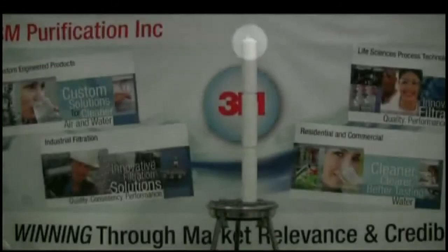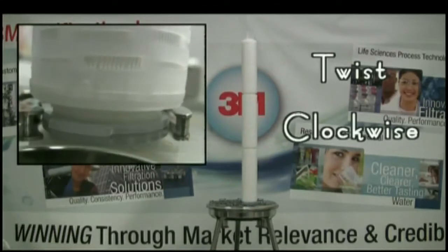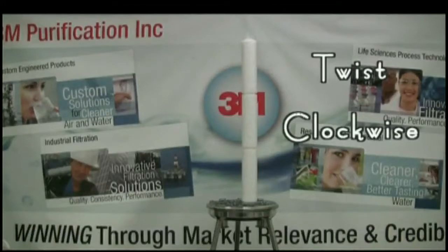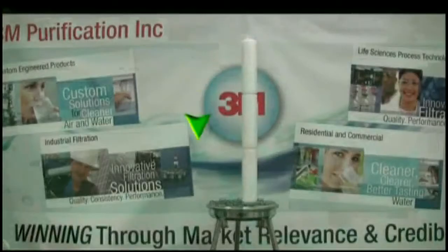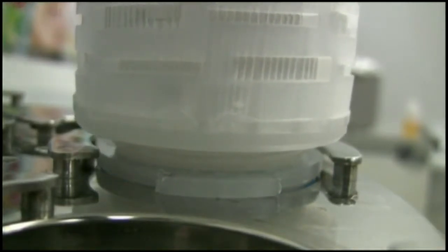When it appears the O-rings are not visible and the filter is fully lowered into the receptor, place both hands atop the closed end of the filter and rotate in the clockwise direction, making sure to keep the filter in the perpendicular position. This will position the tabs beneath the housing brackets, locking the filter into place. Conversely, if extreme resistance is encountered when rotating the filter in the clockwise direction, stop. View the brackets on the housing base and ensure they are not interfering with the filter tabs on the connector. If there is interference, the filter is not completely lowered into the receptor. Exert downward force on the filter to fully descend into the receptor before proceeding. If too difficult, remove the filter and begin the entire process again.